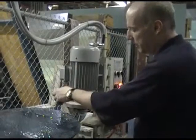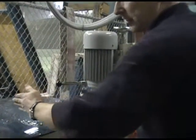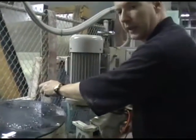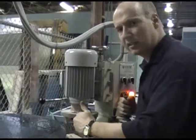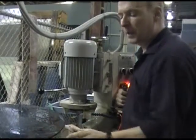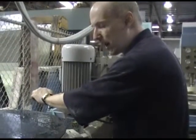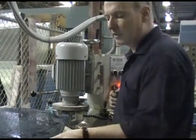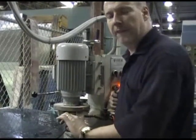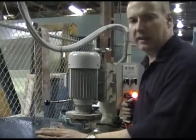It's important to keep the head square, the glass as it's coming around. That's how you get a consistent speed to avoid having bumps in the glass on the edge. You always want the glass edge moving past the wheel. You want the wheel square. The other thing is, ensure you've got the wheel centered. You can usually feel it, and it'll feel pretty smooth and even. You can also look at it to make sure it's consistently rounded.